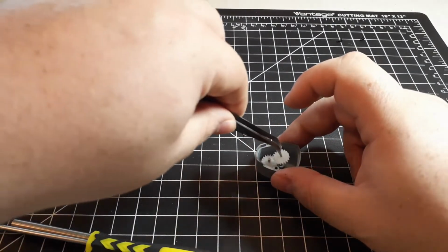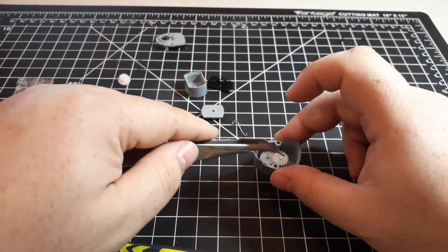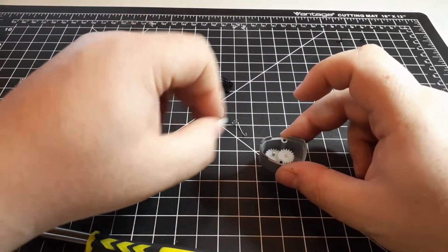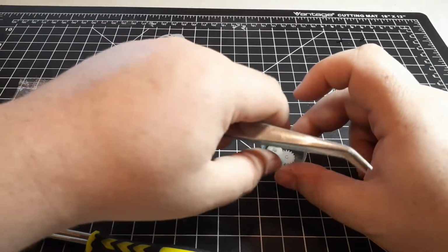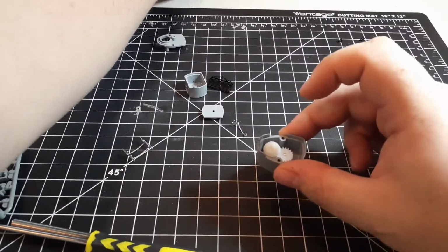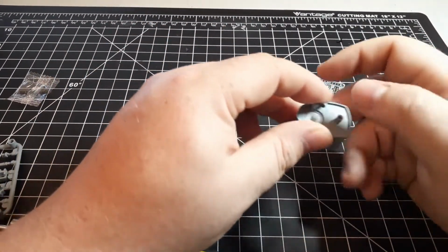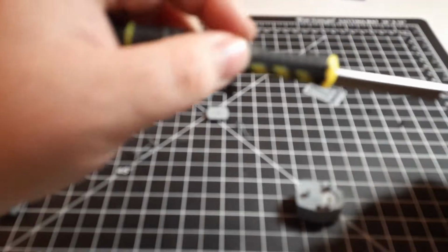Then we're going to take cog 91-13 or 07, I'm sorry, and we're going to drop that down and mesh it with the first cog. Then we're going to take cog 91-08, and that's going to go on the shaft on top of the first cog, and you can see where the motor's going to attach to it, so you know if you've got it oriented properly. Then you're going to take the base plate and fit that down on top of it with two 2x5 millimeter PB screws.